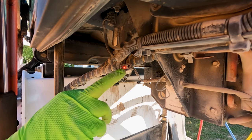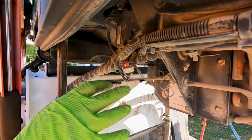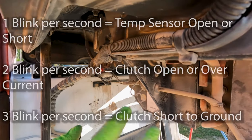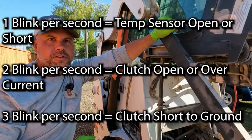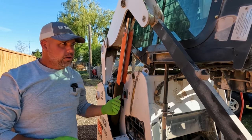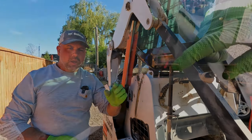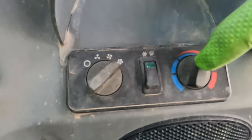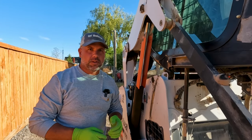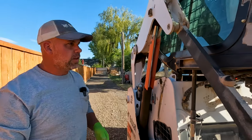This light right here is currently on — I have the machine on and the AC switch turned on, and this light is solid. That means everything's good. If this light is flashing, it gives you a flash code. There are like three different sequences of flashing: temperature, the de-icer, and open circuit to the AC compressor itself. Now, if you ever get that open circuit to the compressor code, a lot of times it's actually in the switch in the cab — that little lighted green switch. If you turn that on and your green light is real dim, you're probably not getting a good contact through that switch to actually turn on the compressor. That's probably the second biggest problem I see on these AC systems.